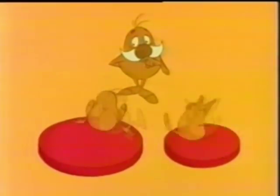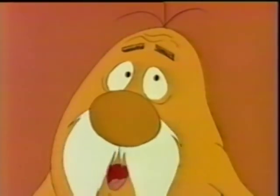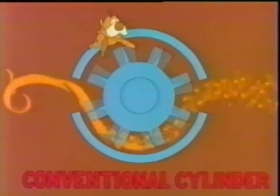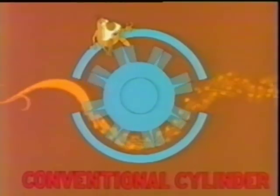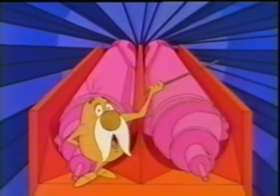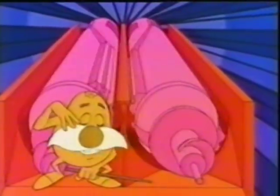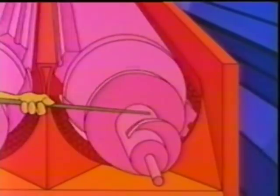It's this extra centrifugal force in the smaller diameter twin rotors that makes the grain let go much quicker. And that's why you'll get less crop loss and a cleaner grain sample, too. But there's much more to it than that. Let's talk about grain damage. A conventional combine has eight rasp bars on its cylinder and needs every one of them to deliver a quick, harsh flailing action on grain. When it's turning, some of the grain can't get out of the way of all those rasp bars quickly enough — like a punching bag, grain bounces around and gets socked many times. But a twin rotor combine has only two sets of rasp bars on each rotor, set far apart. The extra centrifugal force is very helpful here too — grain lets go quicker, so it gets out quicker through the grates with less grain damage.